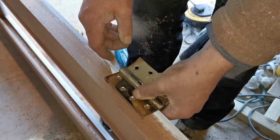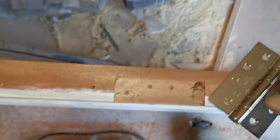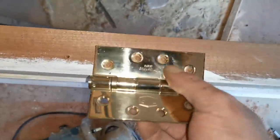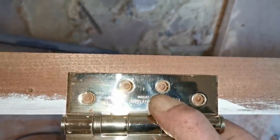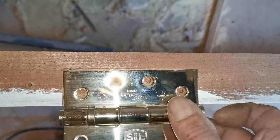I don't know if you can see from there. You can see my holes are exactly centre, so what I'll do is put one in that's got its hole towards this edge so as it goes in it'll pull the hinge in.